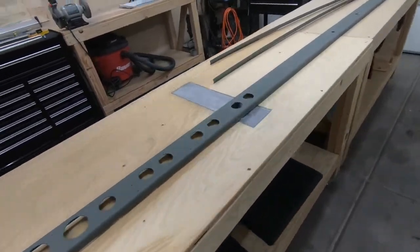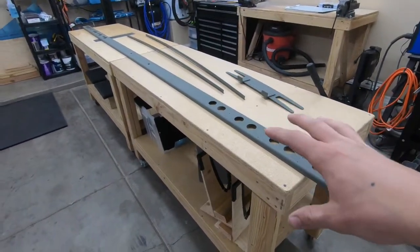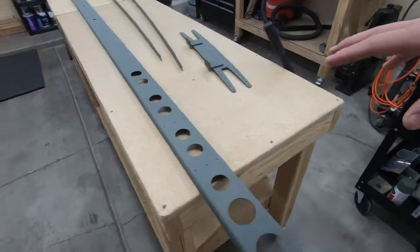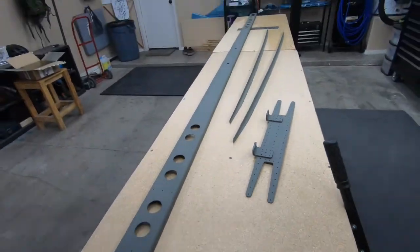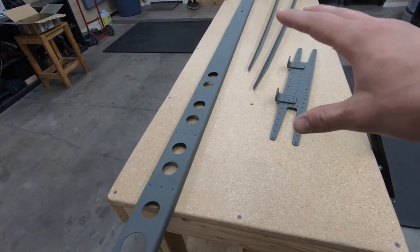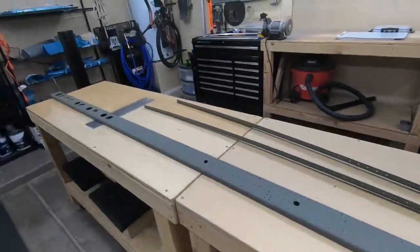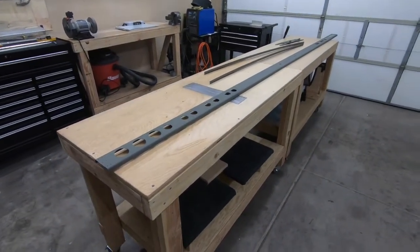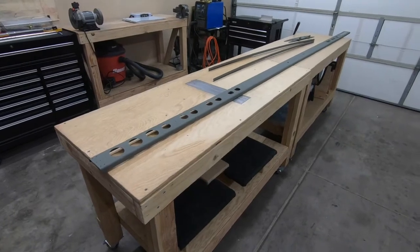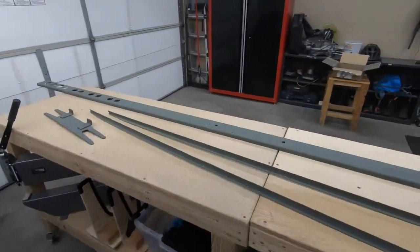I did go ahead and end up priming all of the parts here, so they're ready for assembly. I'm going to end the video here though. We'll catch back up on the next video getting this riveted together for this forward-facing spar and move forward from there. You'll see it all ended up getting match drilled together and went through really well. I know I said previously that I wouldn't prime everything, but this one, being located deep inside the forward portion of the horizontal stabilizer, I just wanted to prime it and forget about it. If you made it this far, thank you so much for watching — hit that like button, subscribe if you haven't already, and that notification bell lets you know whenever I upload a video.